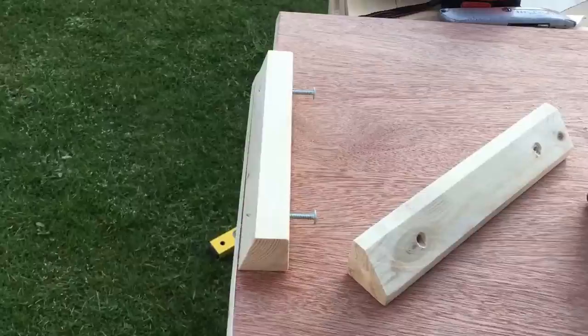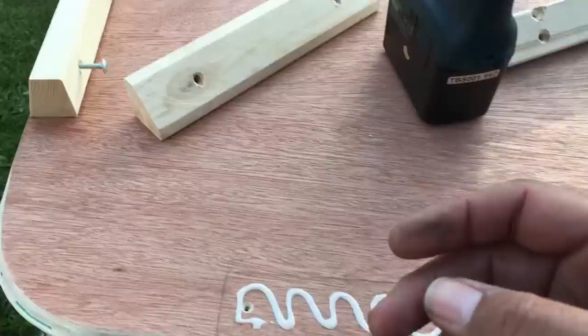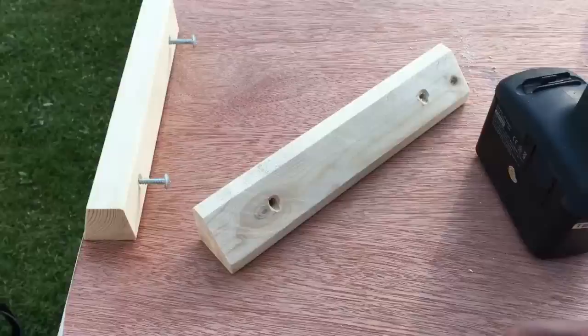This is the bit of board that we've cut for the shelf over the bulkhead, and what we're doing now is these angled blocks. I'm just gluing and screwing these to the shelf. Then we're going to cover it in the grey carpet so that it covers all the screw holes that are underneath here, and then with these two screws and the screws in the rest of the blocks, we can then just fix it into position and you won't see any fasteners from underneath.